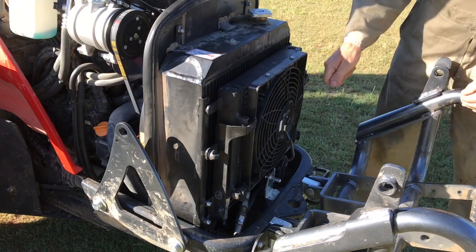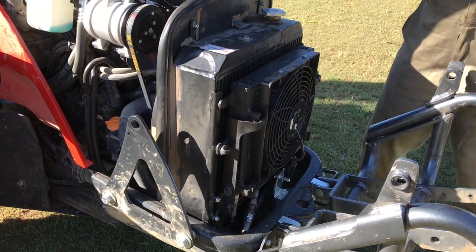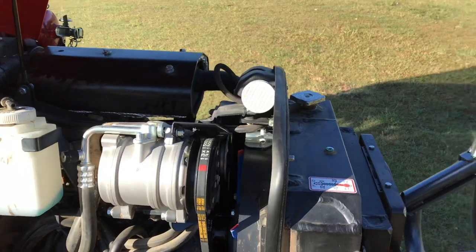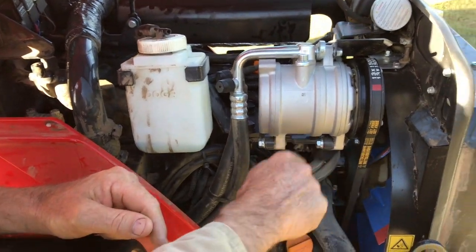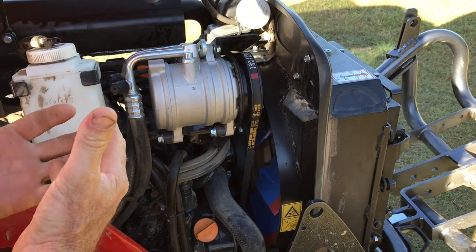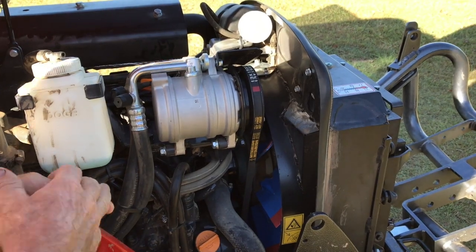get your air compressor and get in, blow it around between the cores down there, flick it in around here and get in from behind the engine driven fan, so that you're blowing the air back the other way. Get your nozzle in here as best you can between the blades and just flick it around. It's best to flick the nozzle, because then you've got that sudden change in velocity of the air, which will dislodge clumps of dust.